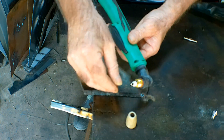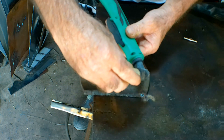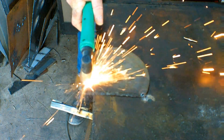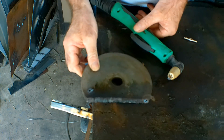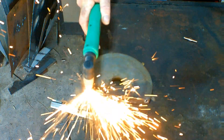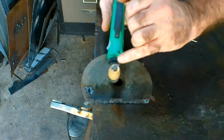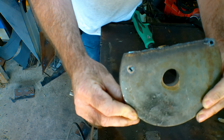Got a new electrode in, we'll use the same swirl ring and put a new cutting nozzle in. So this is a new set of consumables. Got it out of the box, now let's get into it — cut through this sucker. Oh shit. Well, that's not going like it says on the box. Give it another go guys. We're through! But then you look at your torch and say, shit, what did I do? I melted the end off my consumables. As you can see, it's actually blowing a hole through the 10mm plate but it's also buggered your consumables instantly.